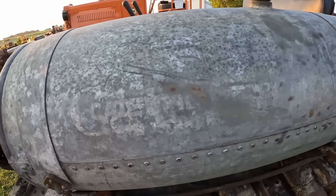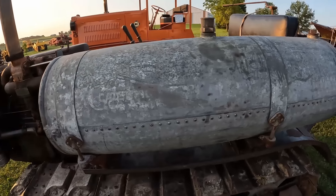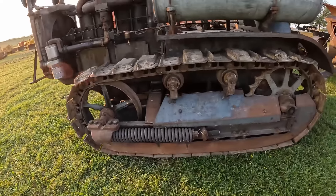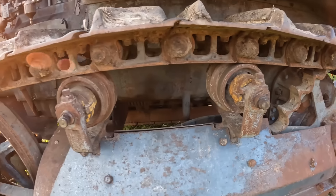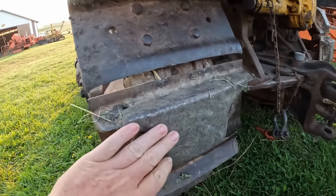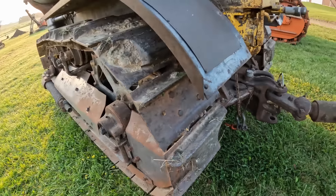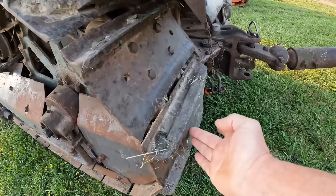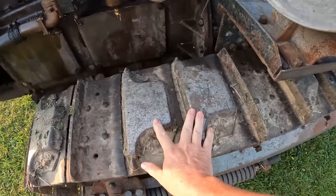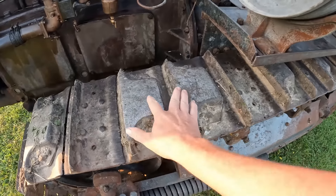Very much original finish yet — you can even see some of the old Caterpillar lettering left intact on the side of the tank. Round fender tank, riveted and soldered construction, very very neat. We've got the original style cap up there yet. Undercarriage on this is very stand-up; I would put this as a rather low-hour 30. We've got the factory attachment bolt-on street shoes — street plates. These were just a flat steel plate that came up over the top of the grouser, and they alternated them every other one.